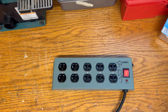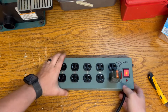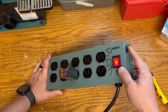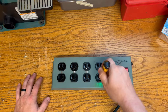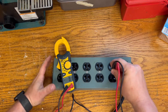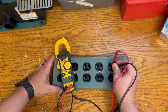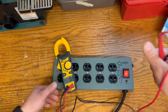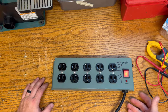When troubleshooting these things, like we looked at with the truck, let's start with the easiest thing. This is just an outlet checker — not a GFI checker, just an outlet checker. I plug it in and no lights come on. I try to push the reset button, nothing. I've got my idiot stick and I've got power on the cord but nothing on the outlet. Line to neutral: nothing. Line to ground: nothing. So that eliminates the idea that we have a missing neutral — sometimes it's a missing neutral, as simple as that.